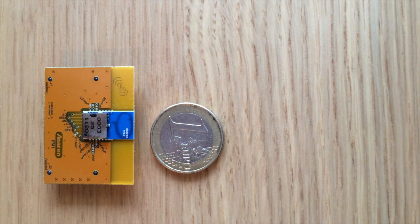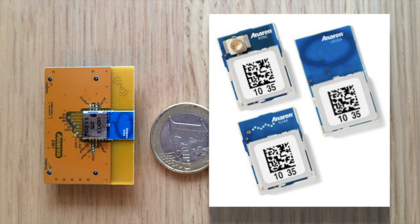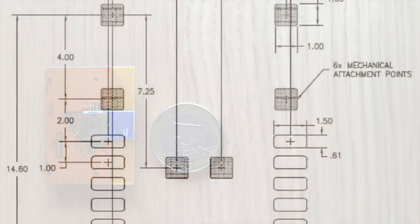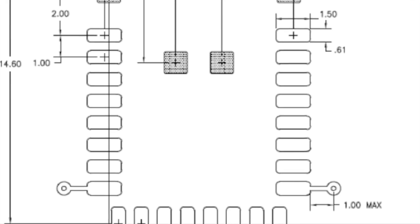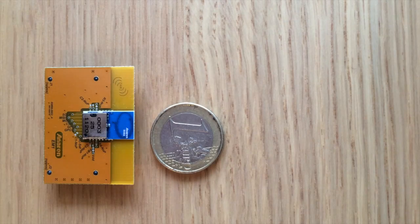The interface board costs about 30 euros. Why do I use this expensive interface board instead of directly using the radio module? The answer is, I am not good at soldering and these chips nowadays are pretty tiny. The radio module comes as a so-called LGA, land grid array, which is a type of surface mount packaging for integrated circuits having a square grid of contacts on the underside of the package. So I think, besides major experience in soldering, you also need special equipment like a rework station.